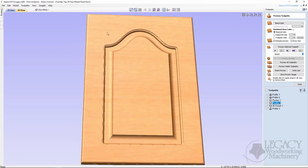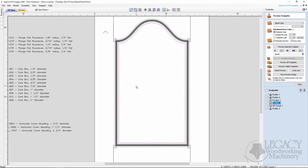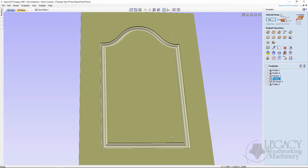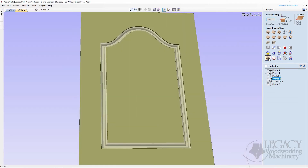The 3D carving was done by taking the same shape of the cutter, creating a 3D component of the exact same toolpath, then carving just in those corner areas. Here is the 3D model — you can see the corners are nice and sharp. We control where the 3D carving takes place by creating corner boxes that limit the cutter to work only within those highlighted vector areas. We use a very fine 1/32-inch tapered ball cutter to achieve the detail in those corners.